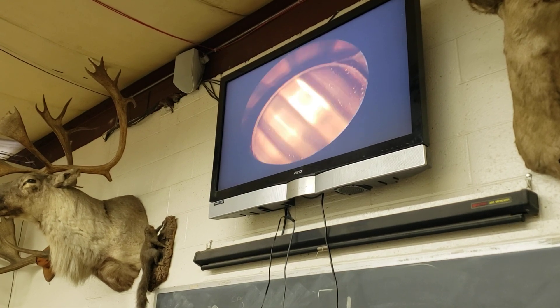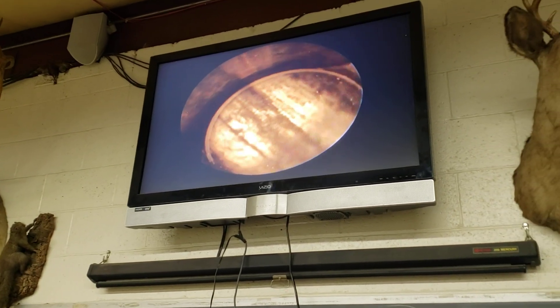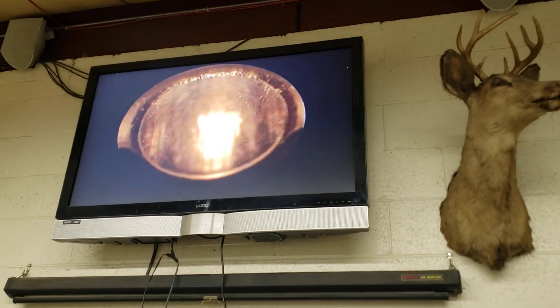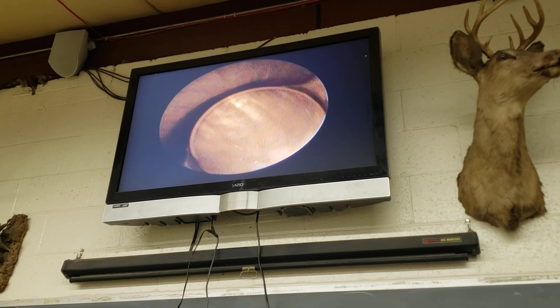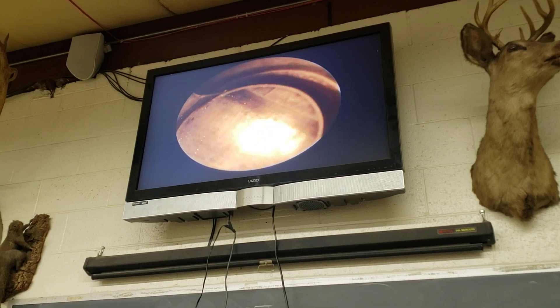The major concern was back here at the throat — the throat erosion. This barrel, with the condition that the rifling is in at the end, I'd probably set it back and see if it shoots again. You can save the customer a couple bucks over re-barreling and see if his reloads and everything still shoot through the gun. And that's where we're going to start. Thanks.